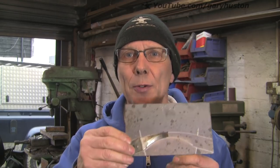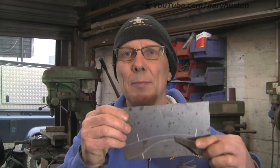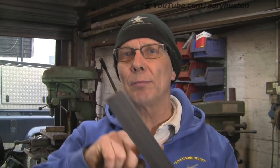This is another part of one that's broken. I've laid it onto a piece of steel and just drawn round it, and done the same on the other side. So that's my rough template - I want this piece here. I'm going to take this and try and bend it to that arc, then anneal it, cut out the little semi-circle, try and sharpen it up, and see how we get on.